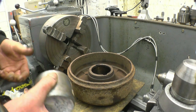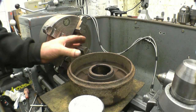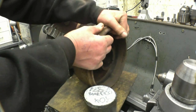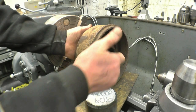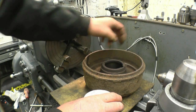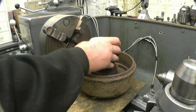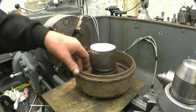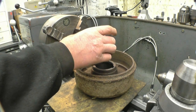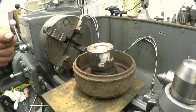I've got a couple of bar ends — I want to turn some tapers that are a good fit in there. Drill and ream them to one inch, and I've got a mandrel that I can set them on the lathe. I'm going to grip it between two tapers and machine it that way. That way there's no setting up time — you just put them on and do them. It would have been better if he'd left the bearings in, but there's a machined face that just wants cleaning up, then a taper in there on the other side. It can't be anything but running nice and true. So the first thing we'll do is square these up, drill and ream them to one inch, put them onto the mandrel, and machine the tapers.